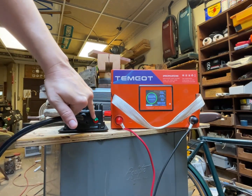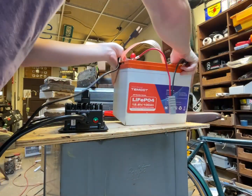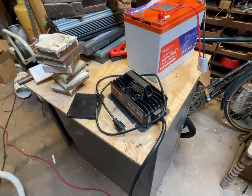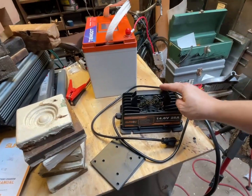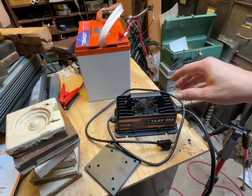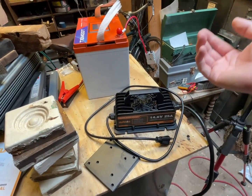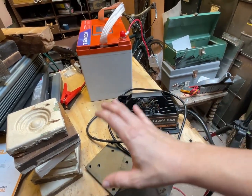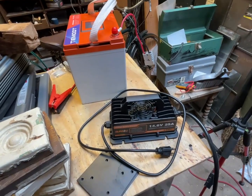This one looks like whenever it's fully charged it just goes to green. In this experiment we were taking solar power and just moving it between batteries, and that's basically my thought process for this. If we have another power outage where we need to charge up batteries, I can charge up batteries from the wall — grid power. If I also want to do a system where I move power from one battery to another and I don't have something to move 12 volts to 12 volts, this could be good to pump 300 watts from one battery system to the other. Because I'm working with stuff that I get for free, I can't plan out having a huge power system. So I'm probably going to have a few separate solar panel systems, and I can have them cascade one into the other if I need to allocate power into one.